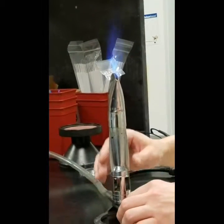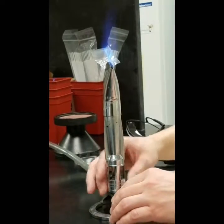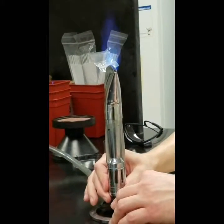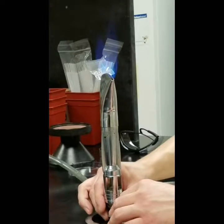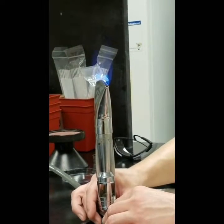On all these burners, the more oxygen you supply in with the fuel, the higher heat you're going to get. If you close it down it may be a prettier flame, but if you open it up you're actually going to get a higher temperature with more oxygen. It can be a little tricky to get it tuned.